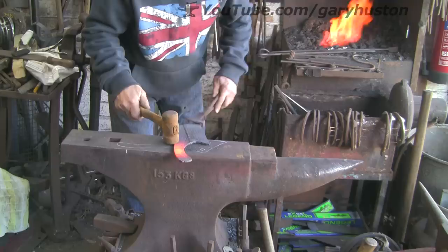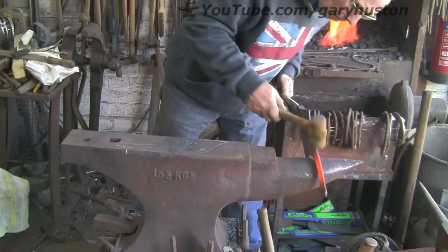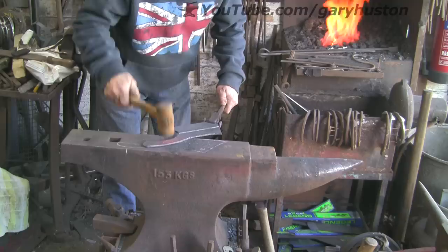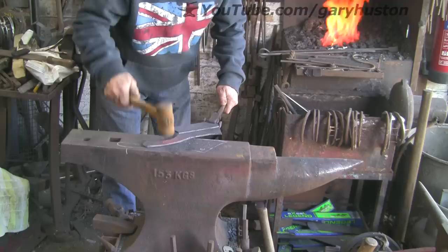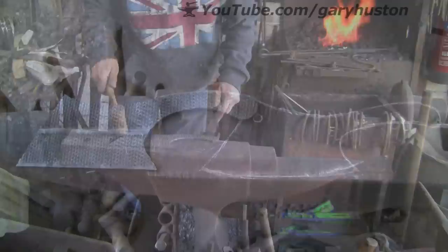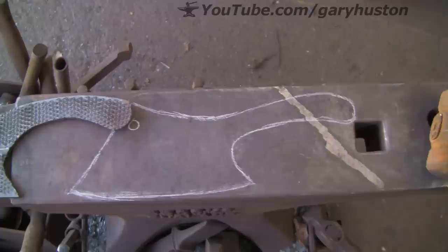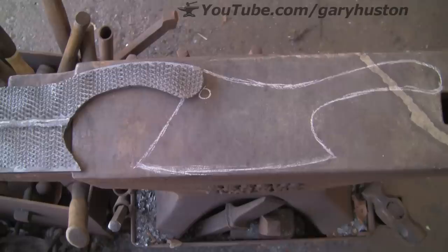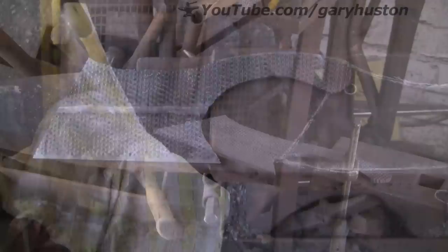Just like turning a shoe. It's better already - that's literally just one run over the beak. So I'm just going to pull it up a little bit more, because I didn't have enough material with the two rasps to get that handle up without bringing it up afterwards. I just gained a bit of height by pulling that up. There's no set rules, it's all eyeballed. I'm going to put a little shape in the bottom there. I'm going to grind that weld off next.